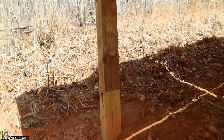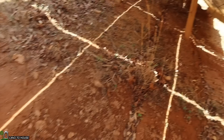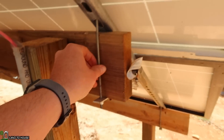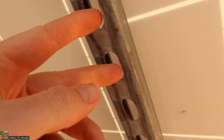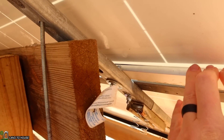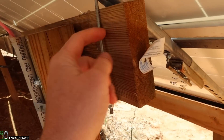I have either 4x6s or 4x4s sunk about two feet in the ground, coming up here to a 2x6, and that 2x6 is bolted onto the 4x4, as you can see right there. Then I've used this unistrut, which is also called super strut — it's this metal channel, and the spacing here on these holes worked out perfectly for mounting to the panel. If you're looking to do an install yourself, that was pretty quick and easy. I cut some aluminum bar down here and used some all-thread to lock the panel mount to the wood frame, and did that on each of them.